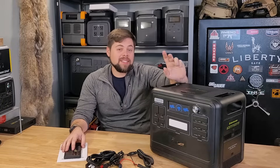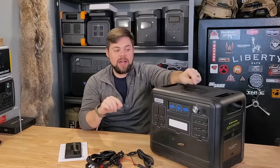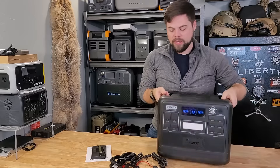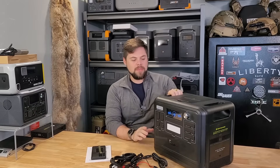The inverter is a decent size at 2,400 watts, which means you can run anything you'd plug into a normal wall outlet off of this with great ease, as long as it doesn't have a huge surge peak. A large air compressor may be very difficult to start because of the large surge to get going, but running a small pancake air compressor would definitely be possible. Most people are going to be looking at this to run something like a fridge, a freezer, lights and fans — something remote or portable. It is definitely portable and manageable, though it's definitely heavy.